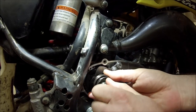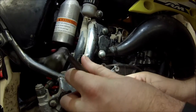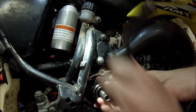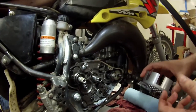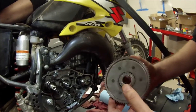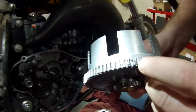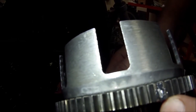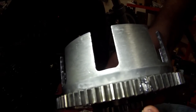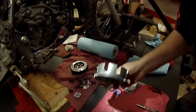We found a little chunk of debris in here. This needs to be supported on its bearing to fully operate without issues, but it was acting just like before. When we flip this over and get a flashlight on it, you can actually see there was a chunk of aluminum wedged in one of the gear teeth. That makes sense why it would go 360 degrees and lock up, then turn the other way 360 degrees and lock up again.